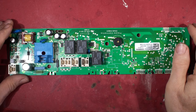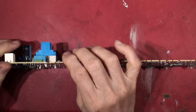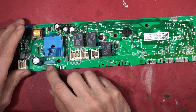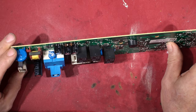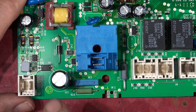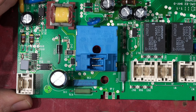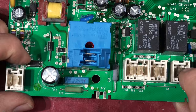Let's have a quick look at the controller. We've got the mains input on the back, the main rotary switch here. Power comes into this resistor with a filter capacitor - this is usually a 47 or 33 ohm resistor, just to stop the inrush current surge when you hit the power. It charges this capacitor up, which is an EPCOS 22 microfarad 400 volt capacitor - that's the main high voltage reservoir capacitor. That thing can store some charge, so if you're playing around with this you need to discharge it after disconnecting power, otherwise there could be a significant voltage on it - it's like a small battery. It goes through this resistor through a rectifier, and this capacitor on UK mains at 240V would be something like 360 volts.